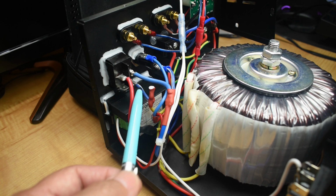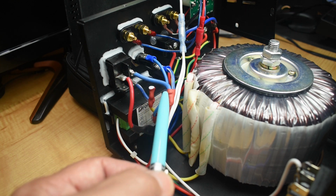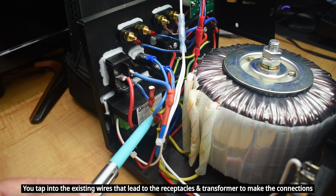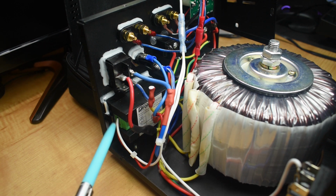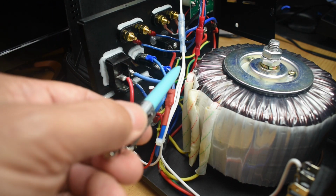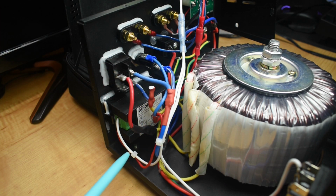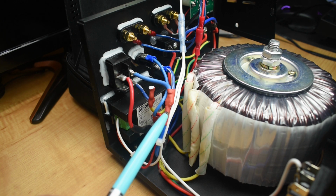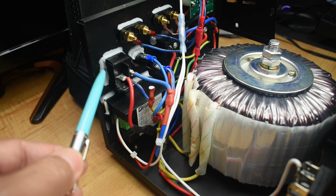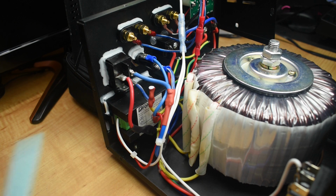Now if you look at the switch, the power comes in to the bottom of the switch. When the switch is turned on, power jumps up to this point here, and then it goes directly to this fuse holder. This connector here winds all the way around, and it supplies power to that gauge, as well as the transformer and switch mode power supply for the 12 volt output. The neutral for the transformer and 12 volt power supply goes right here, straight up into the cover, and you can see it goes down, and the neutral also goes over here, and then the neutral goes where I showed you in the beginning, right over to the switch. And you can see I put some E6000 sealant to ensure that everything is locked in position and will not fall out. I suggest you do that if you make this modification.